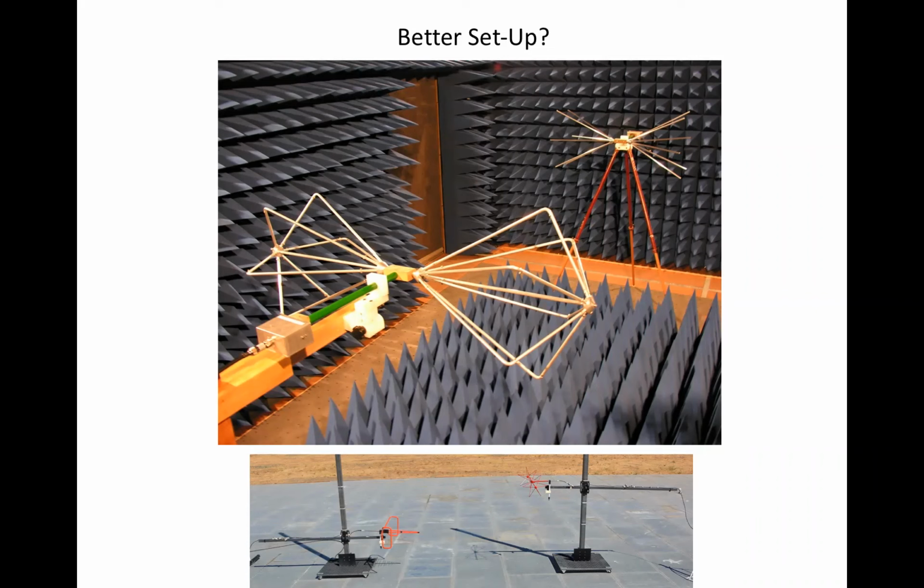Notice that with an absorber-lined chamber, there's no need for a mast to raise the antenna to 3-meter height. If an EMI test facility has a test chamber with ferrite-backed cones, antenna calibration could become a do-it-yourself proposition, which was the original intent back in 1968. But note that even if you don't have this high-end chamber, a ground plane laid down on a parking lot free of obstructions and some ferrite tile absorber would suffice. No cones necessary for the floor alone below 1 gigahertz. Maybe it's time to write a new SAE ARP-958E DIY.